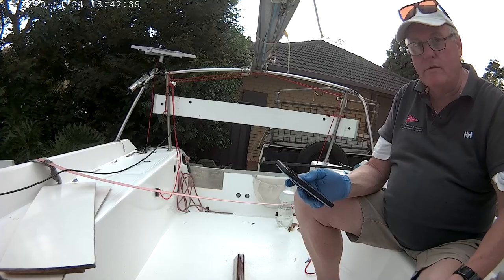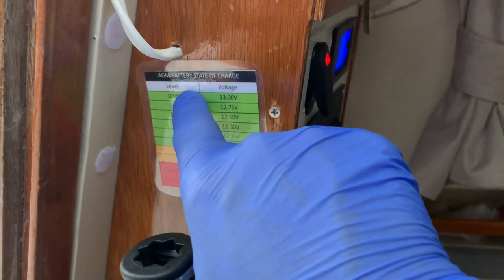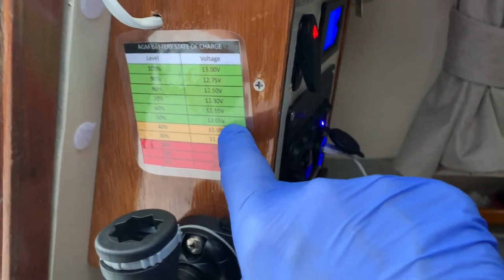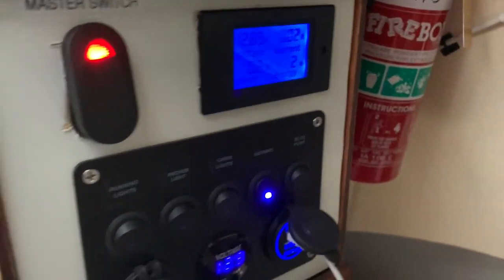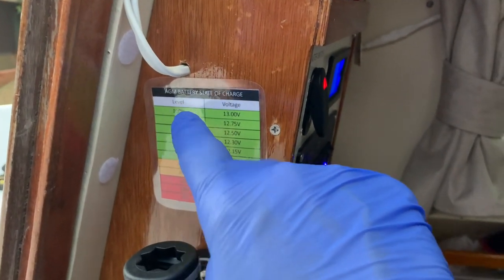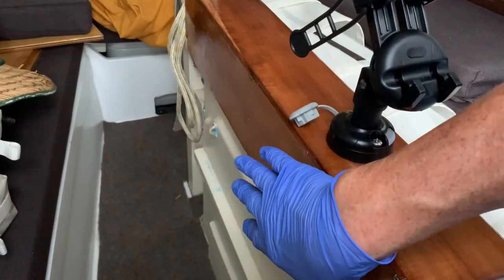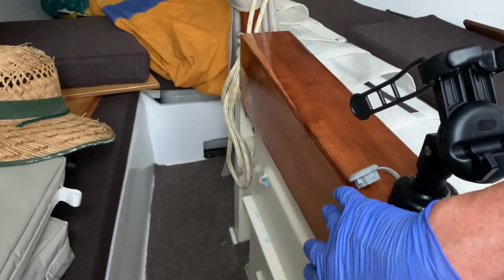It was $59 from JB Hi-Fi. I made this little chart that tells me for my number of volts what my battery level percentage is — I don't really want to go to 12.05 volts. I'm currently sitting at 12.89, so I'm probably at about 95 percent. That's job number five done. Tomorrow I'll get the mast up, sort out the halyards, tone up the forestay, and I still need to do some work on the uphaul cable.